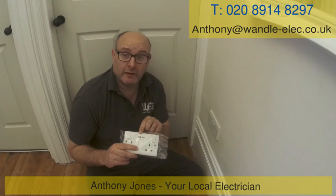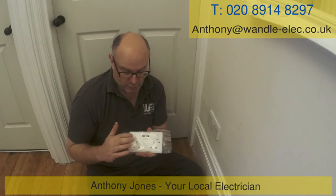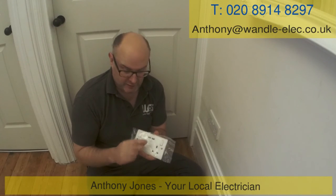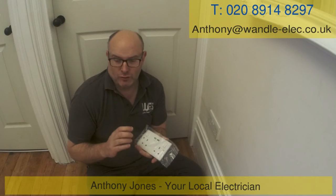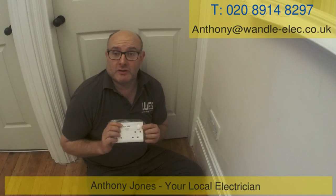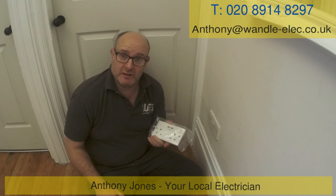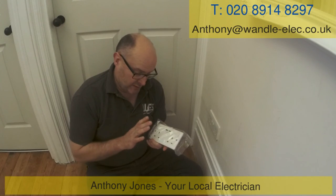Another option, and it's a bit of a quicker option actually, is to change your socket plates to ones with USB ports in them. So you can use the 2 existing sockets, and then you can just put things like your phone or anything that's got a USB connector into those, so you're not having to use plug splitters or bars and not overloading the socket. I've got another video that will show you how to fit one of these. It's normally fairly simple.